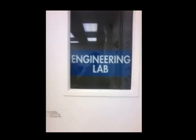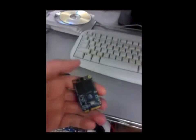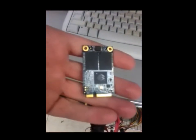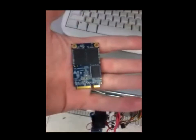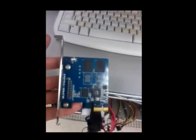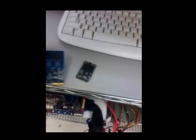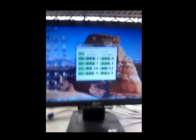Here we are back at our engineering lab. I wanted to sneak my phone in and show you these two products as we're testing them with the real test results. Here's the mini PCIe card — notice the Marvell controller, only four flash placements, and that fifth chip is for DRAM cache. Here's the PCIe version, perfect for upgrading your P55 and X58 motherboards. And here's what you're going to get when you plug it into a Gen 2 slot.